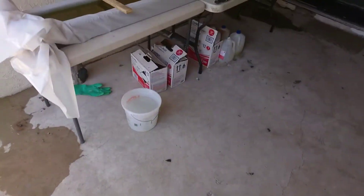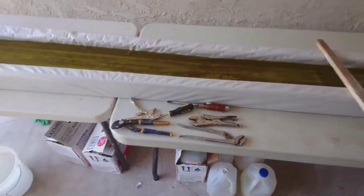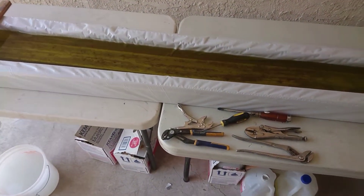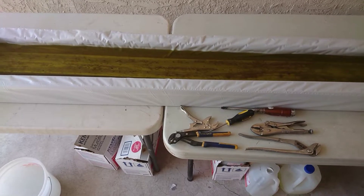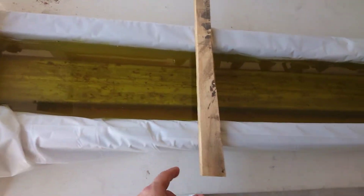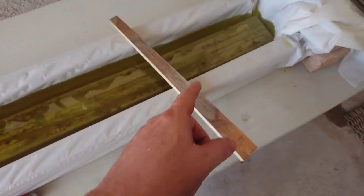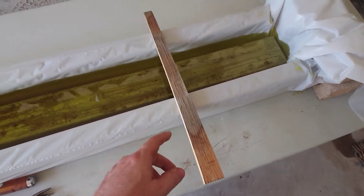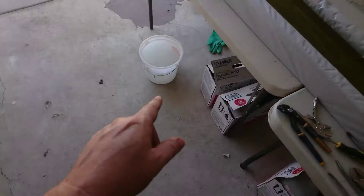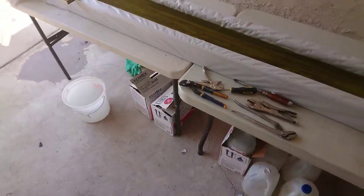I just wanted to show you my method — you guys can come up with your own. I didn't dilute this; I just went straight, I didn't want to mess around with any dilution. I've got about 35 minutes on it now. With rubber gloves, I'll just come and grab it, shove the dowel underneath it and let it drain, then lift this side up, put the dowel underneath the steel and let it drain. Then I'll take it over here, wash it out, and rub it down with the baking soda and water. Very important that you neutralize your acid.